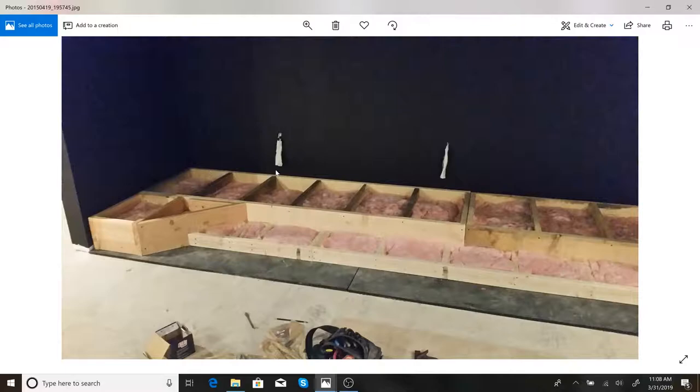I built two rectangular boxes and then two smaller boxes on either end with a 45-degree angle between them. The width is personal preference — mine is roughly as wide as my screen, about 140 inches across to match my 140-inch, 2.35:1 screen. If you put two-by-fours down here it makes a really nice step for your stage and gives it a really cool look — like a real stage. Just all simple framing; I even used some leftover two-by-tens.